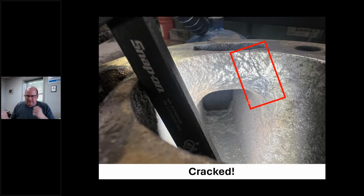Gas car mechanic, right? Zip, zip, zip, zip. You know, slow down, slow down. Most of the time, water in the engine is due to water reversion or something like this, a cracked manifold, something like that. Test this stuff first. Everybody just seems to rip the heads off all the time, like the head gasket's blown. Stop, do this stuff first.